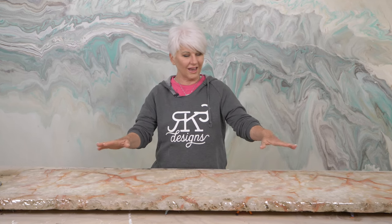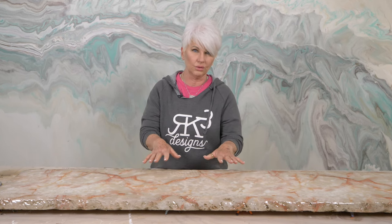It's been 24 hours and now we're going to put the Ultimate Top Coat on. If this were a high-traffic piece I would put another clear flood coat first, but because it's just a little side table I'm going directly to my UTC. If you're not confident applying the UTC and this is a regular color coat or design in epoxy, I highly recommend doing a clear flood coat first — if you ever had to sand down the UTC, that extra flood coat is a barrier between your color coat or foil and your UTC.